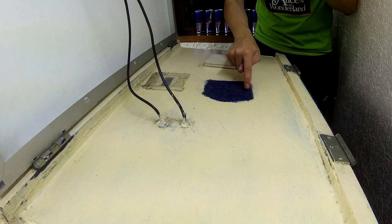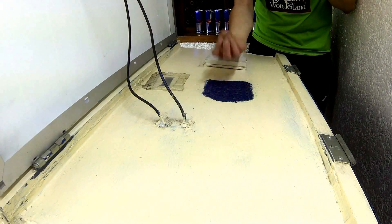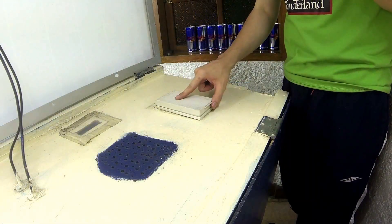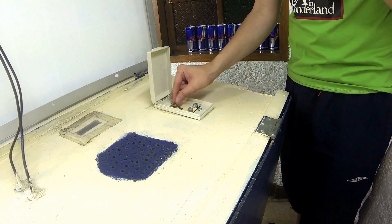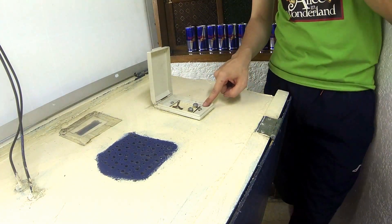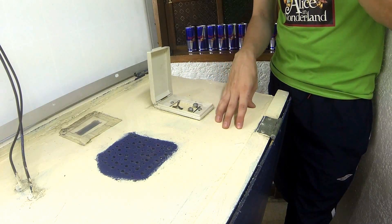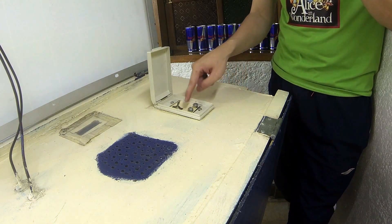There are a bunch of drilled holes here — inside I have an exhaust fan which takes the hot air and battery gases and exhausts them out. This whole box was previously painted blue but then I painted it a more neutral color. Under this panel I have the switch for the inverter which is on the inside. I've also got two terminals here which go straight to the battery — just regular bolts with wires attached inside — which allows me to easily charge the battery without opening the box, for instance using an external AC charger, and also to check the voltage easily.